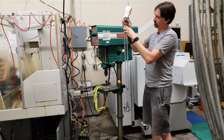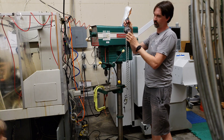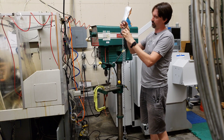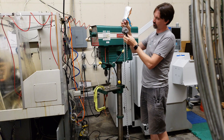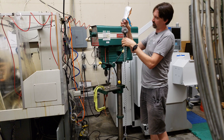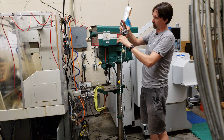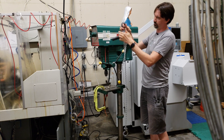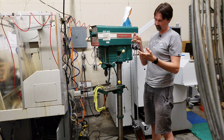You can either rotate the handle rapidly to move it, or swing the handle around this knob which allows you to quickly move the chain up and down. It's got a ratcheting lever which you can switch back and forth, so you can ratchet up or ratchet down. You can use the ratchet as long as you have some tension on it, and you can also just go all the way around like this if you don't have any load on it. You need some load on this for it to really work.